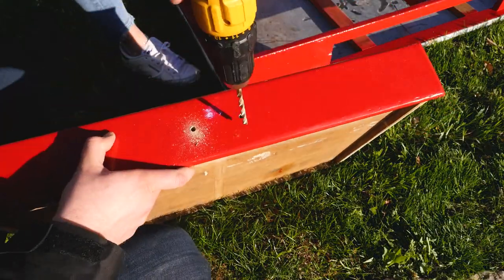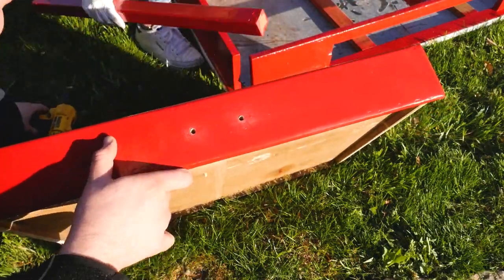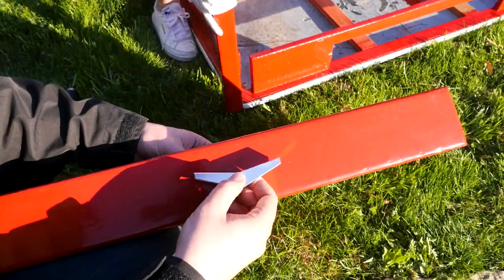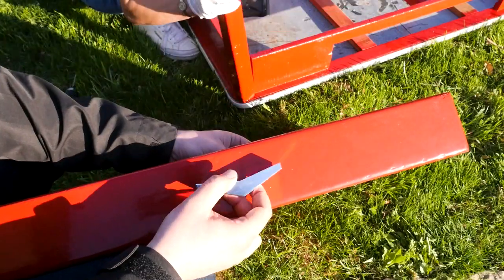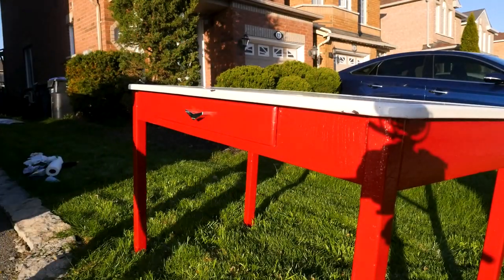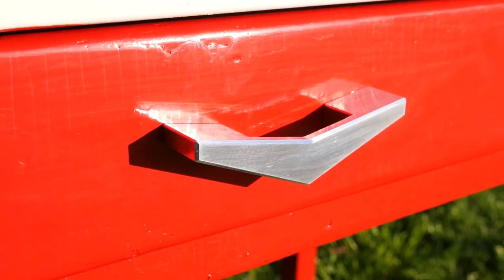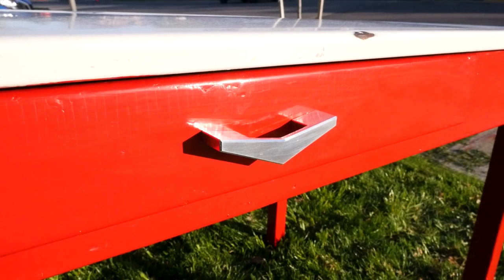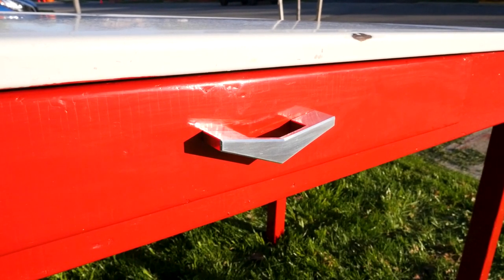There are a few downsides — namely the extra time and material you need to make the fixture plate — but it works so well, and in almost every scenario. Even when the design doesn't conveniently have threaded and dowel holes in it like we had here, you can always place those features off the part and cut them off in the second operation, leaving tabs to support the part before breaking it out. Thanks for watching, I hope you enjoyed the video.